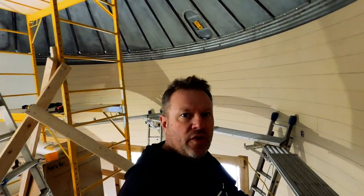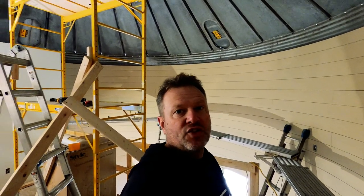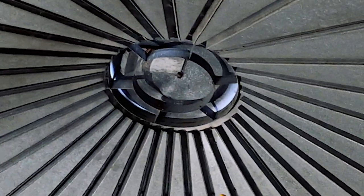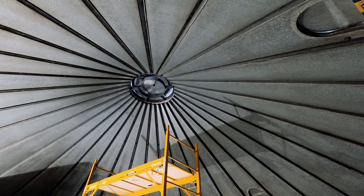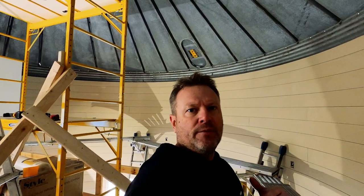Welcome! We've just finished all of our shiplap walls on the curved walls and now we're getting ready to start on the ceiling framing. We're going to frame a round hub to match the hatch in the center of the roof. For future use I'm going to turn that into a skylight, and then we're going to put two-by-six rafters matching the ribs of the metal grain bin roof. Our whole thought is to try to replicate the dimensions of that roof down below.